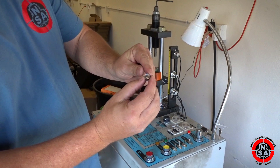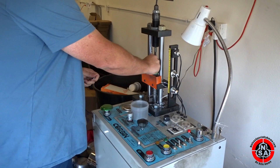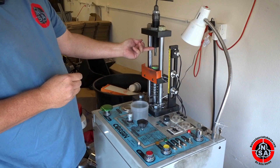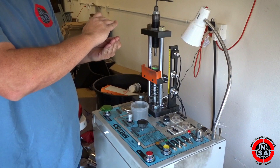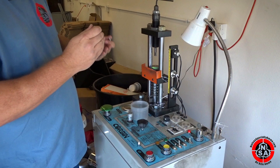An operator would sit here and you're going to see this lead moving out. That lead popping out is because this blank weighs more than the finished bullet. This always stops at the same plate right here. Once it reaches a certain pressure that we set, it then reverses. That's how we get the same exact bullet every time — it stops at the same exact place, so they're always the same length. Because the lead is the same and it bleeds out the excess, you don't get any variation in weight. We're going to demonstrate that with the three bullets we just made.